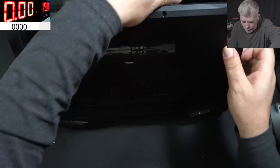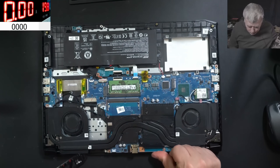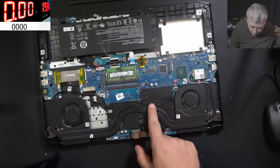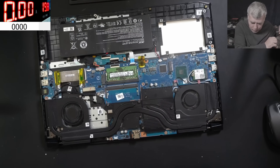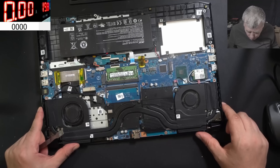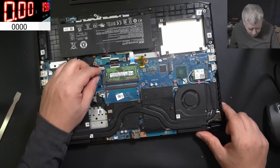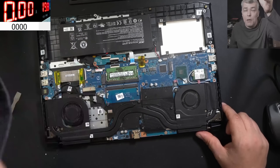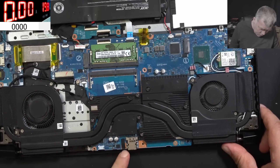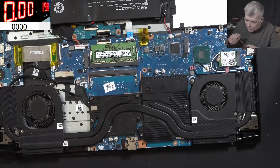The laptop is open. The screws are not in place. Let's unplug the battery and check the main power rail first. It's very easy to check because you have the charging port, then the first MOSFET, the second MOSFET here has some tape, and then we have the current sensor there. Let's check together.